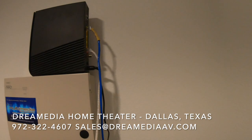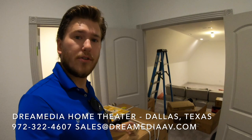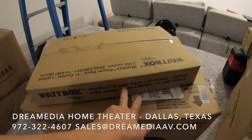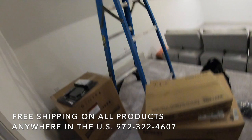I'm going to be using for surge protection the little tiny WattBox for our subwoofer as well as the projector. We want to make sure that the customer's equipment is under warranty if they do get hit by lightning. And then we're going to be using the WattBox Power Rack 11 outlet lighted kit, which you see me use in a lot of our installations. This has 2160 joules, which should be sufficient for the amount of equipment that we're going to have, which is very basic.